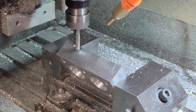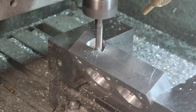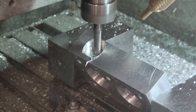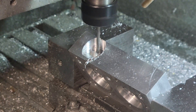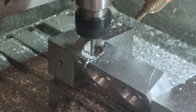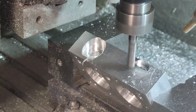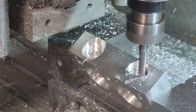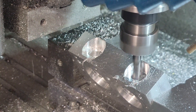Then we hit the go button and watch the quarter inch end mill do its work. This is an eighth inch end mill — it's used to do the finish machining on the threaded hole and the smaller quarter inch hole. I'm using a very light mist, more to cool the part than to lubricate it. The carbide tip prefers to cut dry, but it's important to keep the part cool.